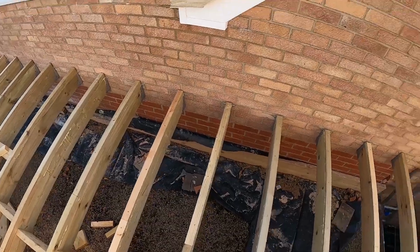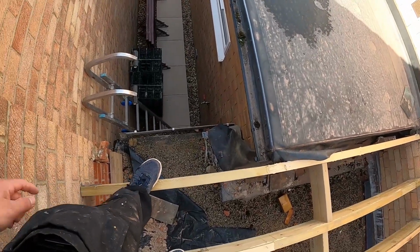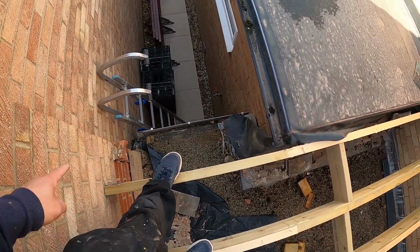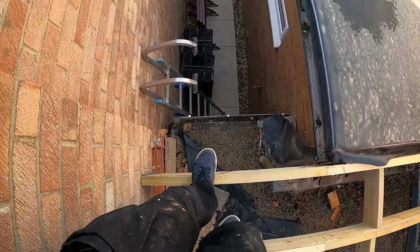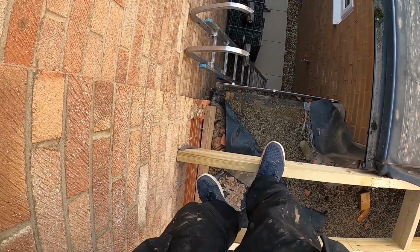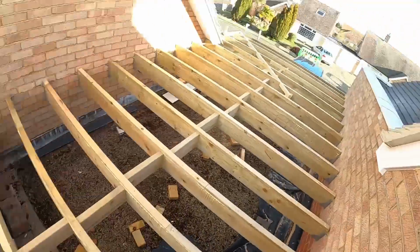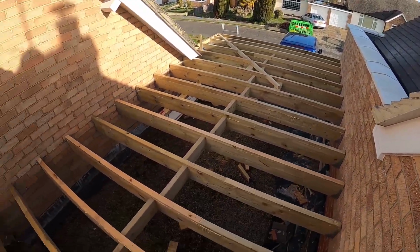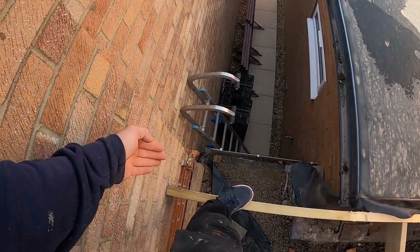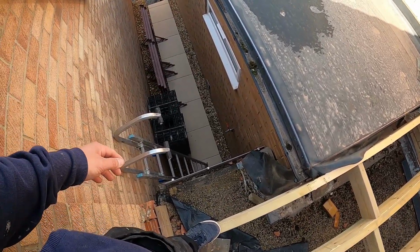But what we're going to do is a tidy up in general, and we're going to put some straps, and we're going to finish this area here, and this area here. We've got to extend, as you can see, this front to copy what's below. So we're going to have to come past this like we've done with that front joist, so the brickwork can go to the underside of it, and we have our fascia capping essentially the timber, and then obviously guttering goes on and so on.